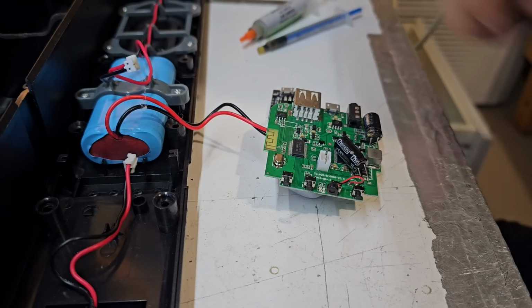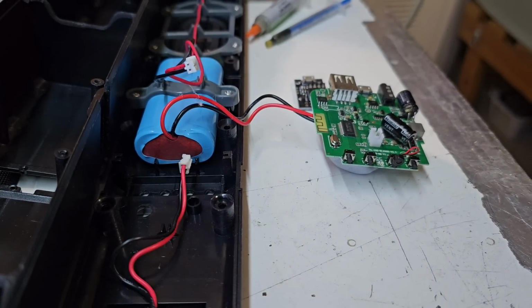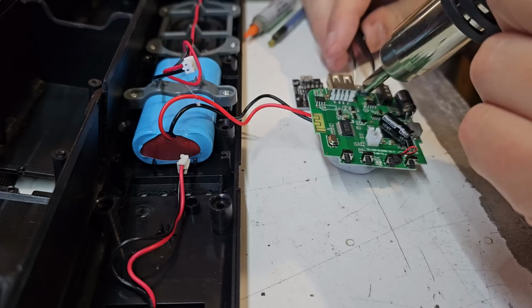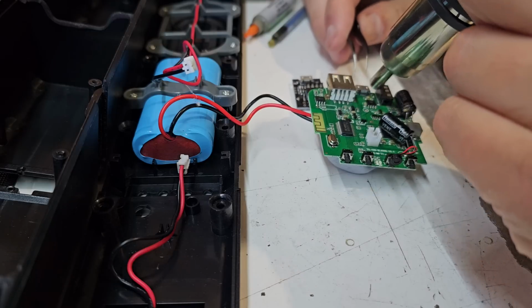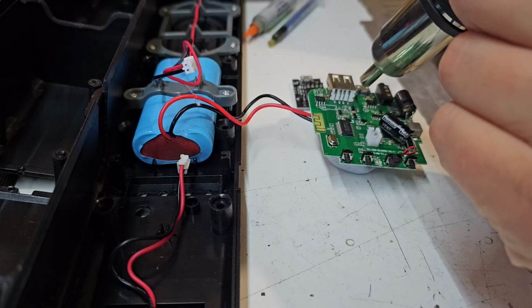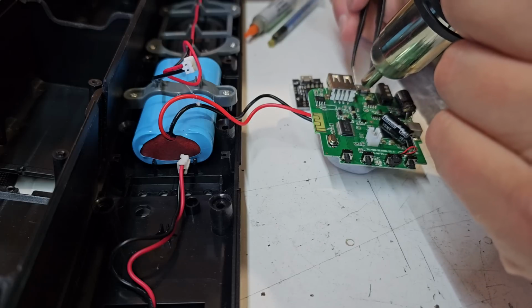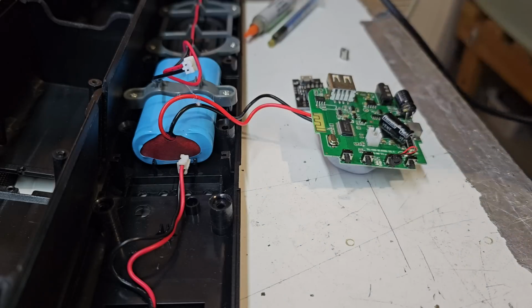Alright, we're going to heat gun this and try and find a good angle in which I can get my arm around everything. Wait for the gun to come up to temperature. See if we can peel all this off. There's always the day where I film things that I have the shakes. Tip here is to keep your tweezers out of the way till you're ready to lift it off the board, which hopefully comes off without too much trouble.